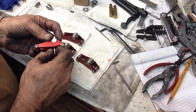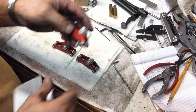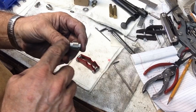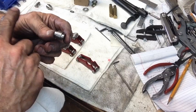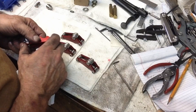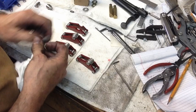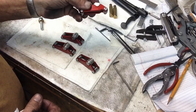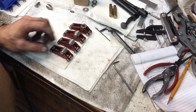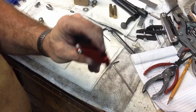Okay, almost done. So there's a completed one. The only thing we have left to do for these four is drill it in the center for five-sixteenths bolts, then machine off the top of it so they end up like that right there. So the completed clamp itself will be just like that. The next thing to do is just go to the milling machine and finish the machining on these. I'm really happy with that - that's a handsome little piece of jewelry.